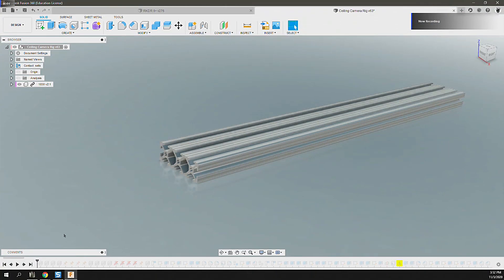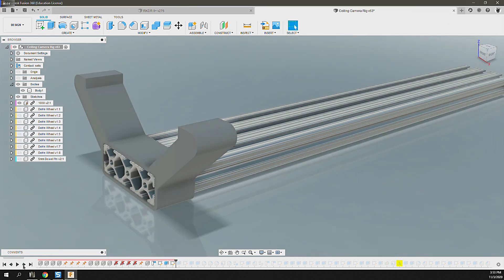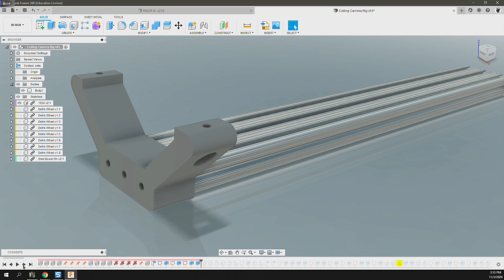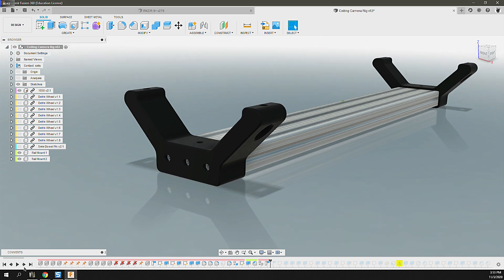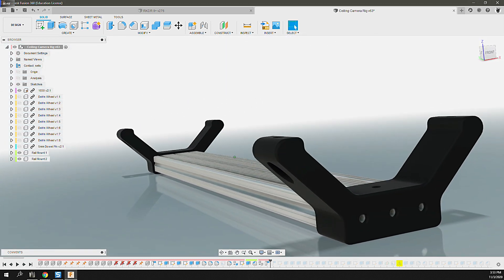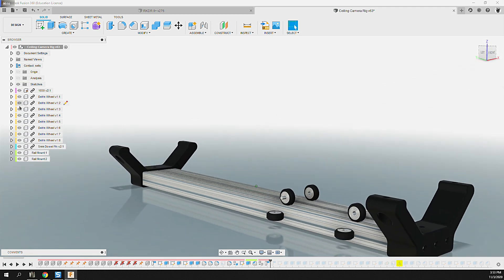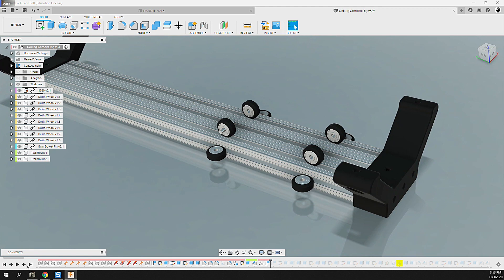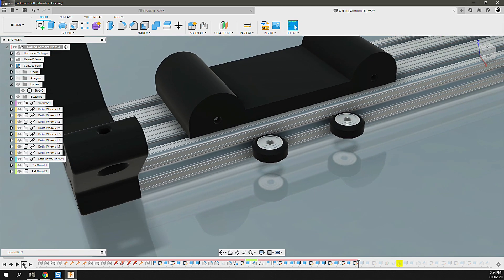Over in Fusion 360 I started pulling in stock components. I searched online and found the 80/20 extrusion models and imported those into Fusion. The first task was determining the best orientation of the rail on the ceiling. After a few different considerations I chose to mount it wide and flat — this would keep it low profile while providing a face to leverage for the lateral forces expected from the main slider body. With that I modeled the Delrin wheels and began placing them in the desired orientation on the beam. I planned for four wheels riding on the top of the beam, four wheels riding on the side, as well as a custom linear bearing milled from Delrin registered in the T-slots on the bottom of the beam. With wheel and bearing contact on all four sides it would prevent twisting while allowing for easy movement in the finished assembly.